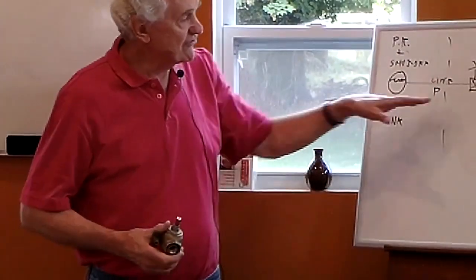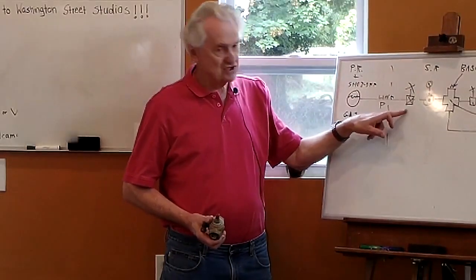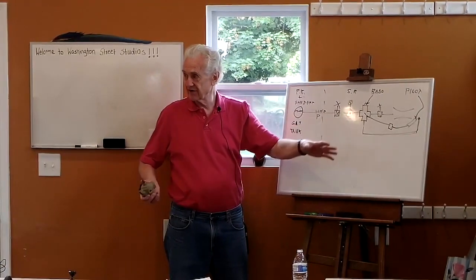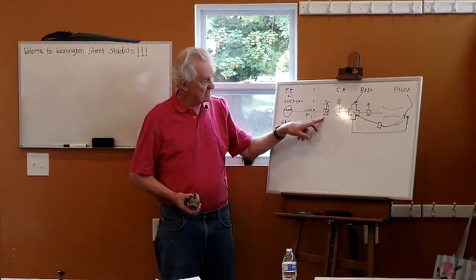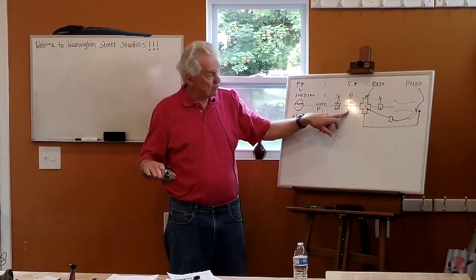So this is the normal sequence that you would want for all these things. You'd want a main shutoff valve. This is the one that kills everything immediately. So if I had a problem, or I was worried about something, this is right at the kiln, I can shut it off. I want a secondary regulator to reduce the pressure to a working pressure.